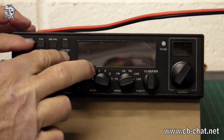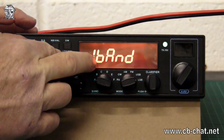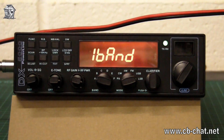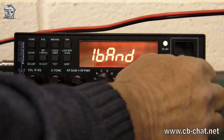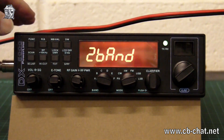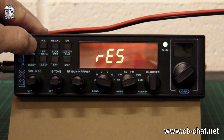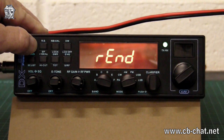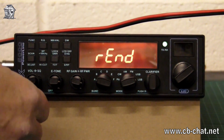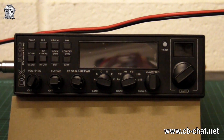One of the first things I had to do with this DX5000 was convert it to the 11 meter band. I wanted to know if the old traditional way worked, and of course it does. You hold down the Function and SRF buttons while switching it on, up comes the display, one band. Turn the rotary to two band, hold the Function button to get the RES, wait until it says RUN, then switch the radio off and back on — it's now wide-banded to cover the 11 meter band.